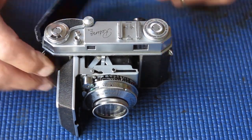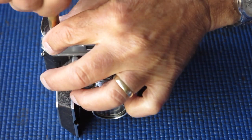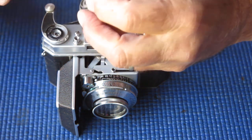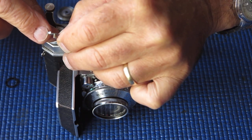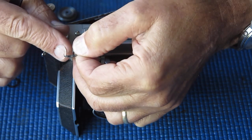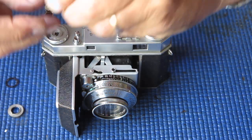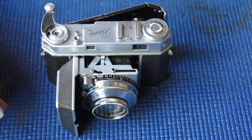I'm going to strip this thing down and find out what's going on, starting with the film advance lever. The screw on the top is loose - means somebody's been in there. There's a spring, a pawl spring - it's present but obviously it wasn't working. It's very soft - and there it goes, it snaps off. So it needs a new pawl; that's why the frame counter wasn't working. The other components in here are nothing remarkable, just dirty.